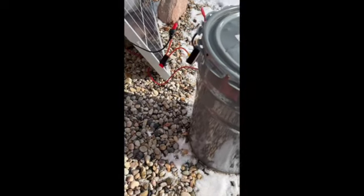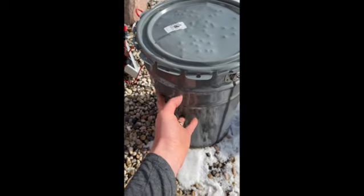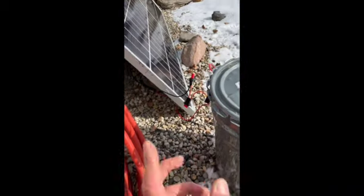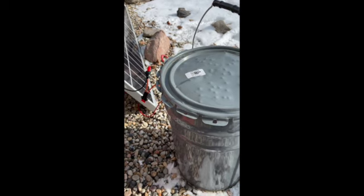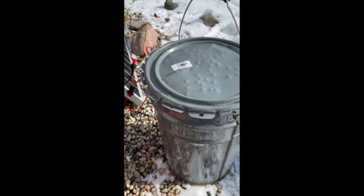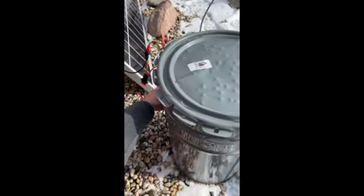It's low amps. But I did a test yesterday just in some 4-liter thing of water, and it had that water heated to 60 degrees at 48 volts off of some batteries, not even off the solar panel at the time, just having the element. Most of it was in the water, and it ended up giving it 60 degrees in, I don't know, about 10, maybe 15 minutes. So it definitely was working. That was my testing. I just seriesed up 4 batteries and did that run.